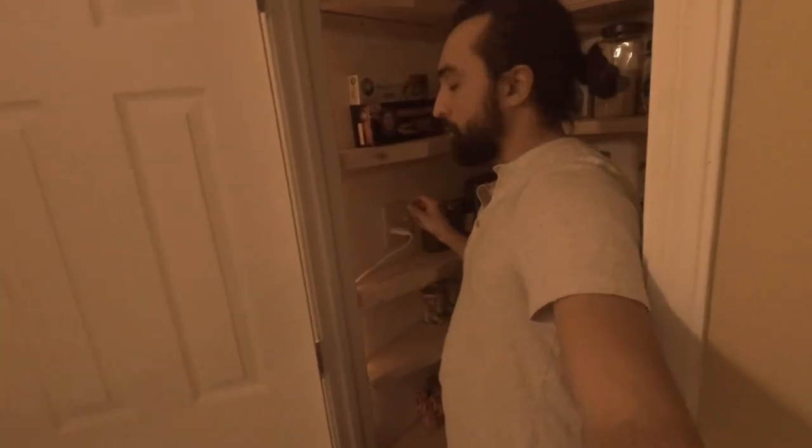Alright everyone, that's it — it's all done, stocked, looking great. To recap: we started out by putting in a power outlet off of the other room and then we put in LED lights. Then we put in ledgers to hook the shelves onto, found every single stud and screwed them in. Then we built some supports to hold the shelves off those ledgers and cut our 6-inch and 12-inch shelves for the back. Finally, we screwed everything together, put a coat of paint on the trim, cleaned up, and stocked it. I hope you guys learned something from this — I had a great time building it. Until next time, my name is Jake. Thank you for watching and I will see you later.